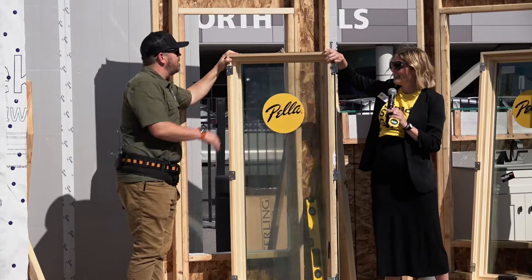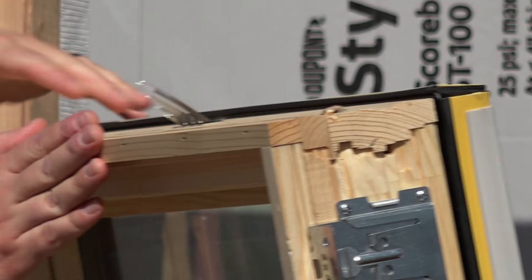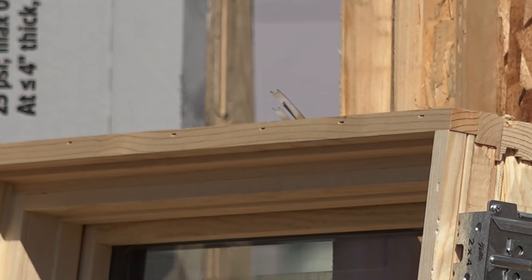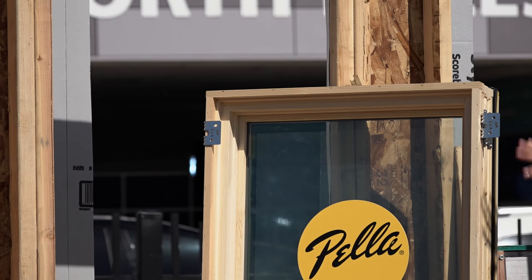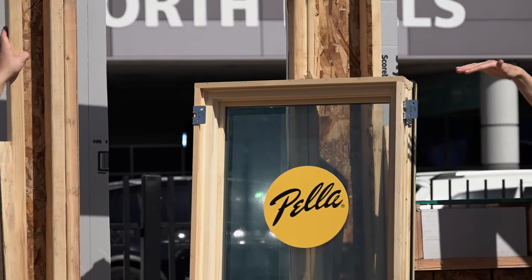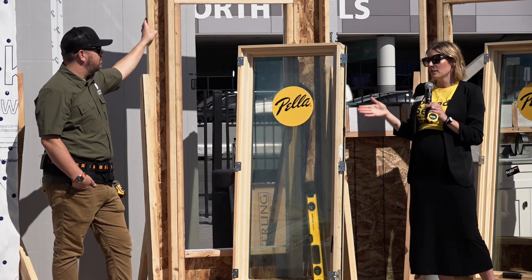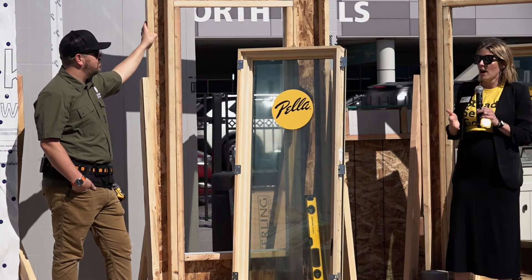On the top we have what's called the head stabilizer. It's a piece of spring steel attached to the top of the head. Step one is flip your clips, and step two is set your window into the rough opening. As you set it in, that piece on top puts downward pressure onto the window, acting as the installer's third hand — one of the key enablers that gets us to a one-person installation rather than two.